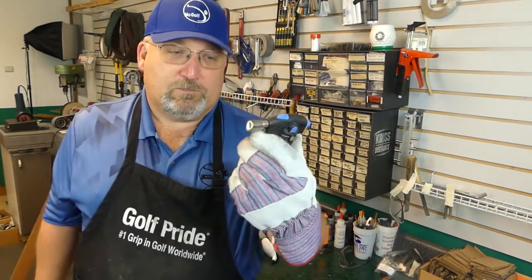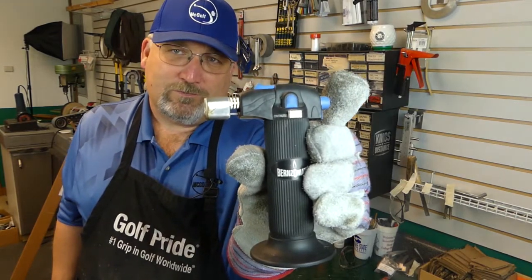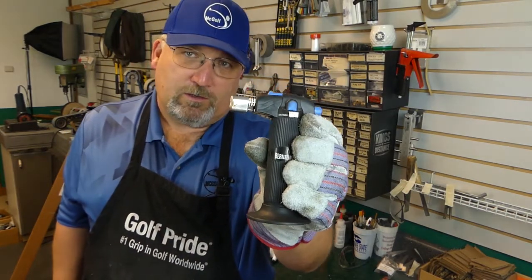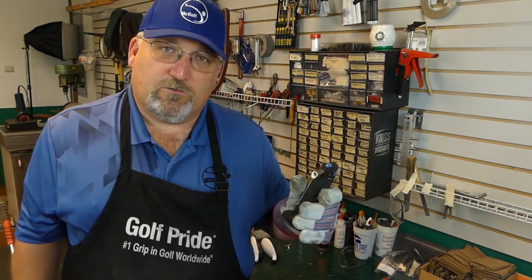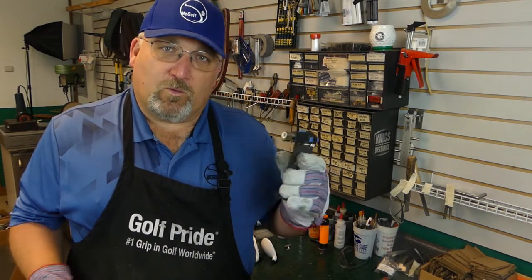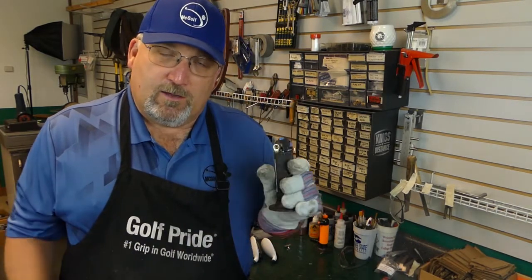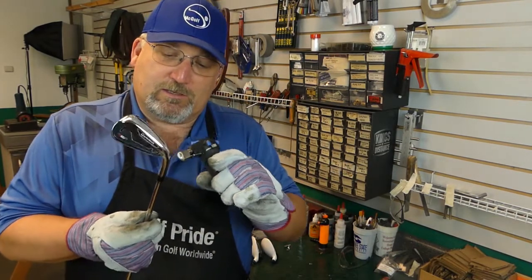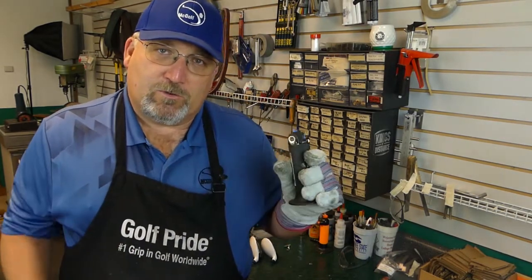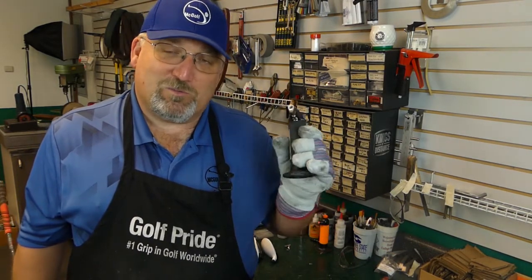Oh, let me talk about this. Applying heat. All right. This is a butane torch. This burns a little cooler and a smaller flame, and it gets more precise of where I can apply the heat. Now, they make propane torches that you usually see for copper work, for sweating on fittings and putting fittings together. It's a great tool for that particular job, and it can be used on something as big as this. But when you're talking about wood heads that have a lot of paint, it gets pretty hot, and that flame is pretty big.